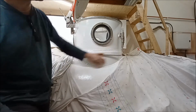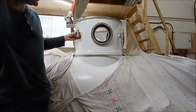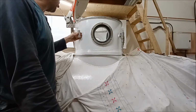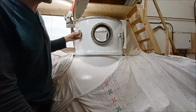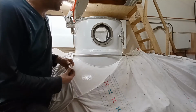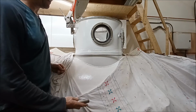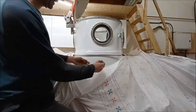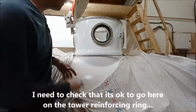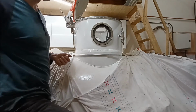I either do the vents the same as the standard vents, and fit the valves on the outside like there, but it would mean a bit of a crossover of pipe work, which might be a bit of a nuisance. I don't know, it might be okay. Or the other thing I thought I could do is put 2 valves, one on either end of the ballast tank, and make a penetrator, put it, say, maybe there, which could then operate each of the valves. That is an option.